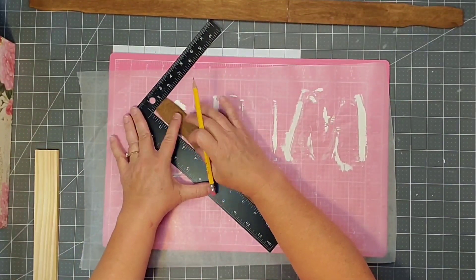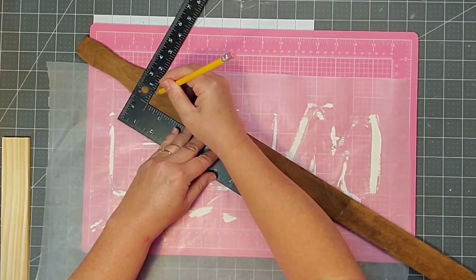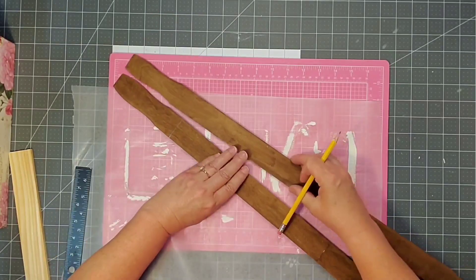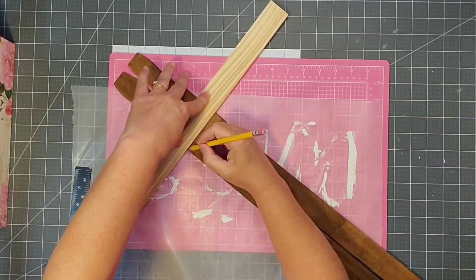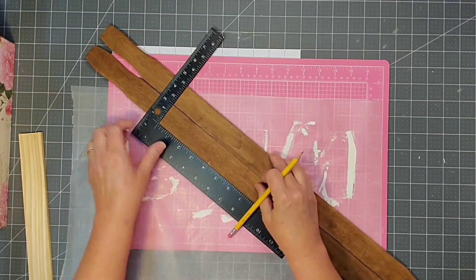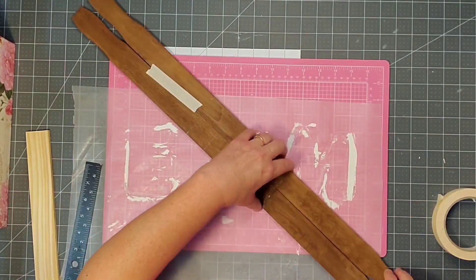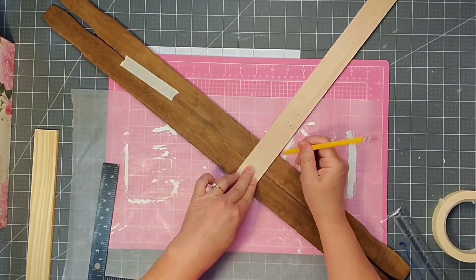I'm going to use my carpenter square to help me lay out my pattern. I'm coming down first with the first measurement at four and three quarters inches from the top and I'm going to draw a line — I'll do that on both pieces of the upper part of my ladder, the longer pieces. Then I take one of my paint stirrers and draw out the width of it — that's my second line. Then I come in four inches below that, start my next line using my square, draw in the length of the board once again, and just repeat that two more times down the board so the third board will be right in the middle of where my two pieces are joined.